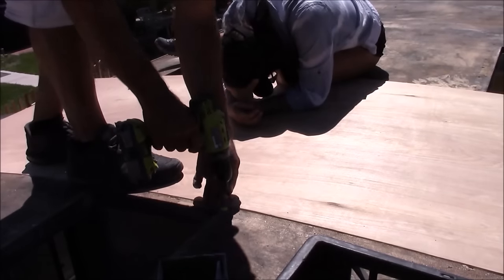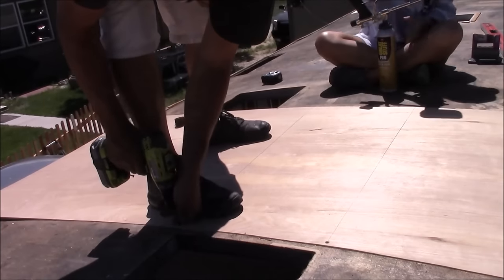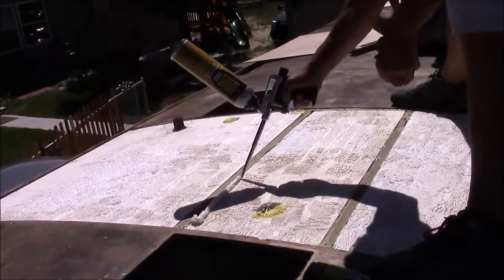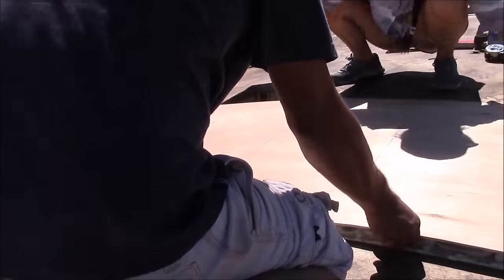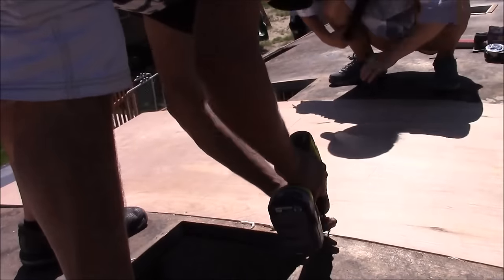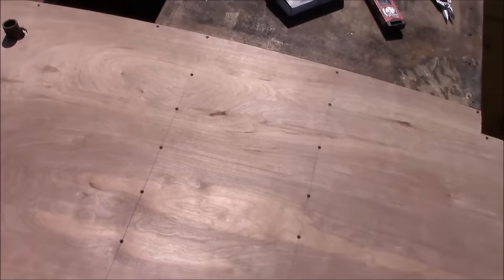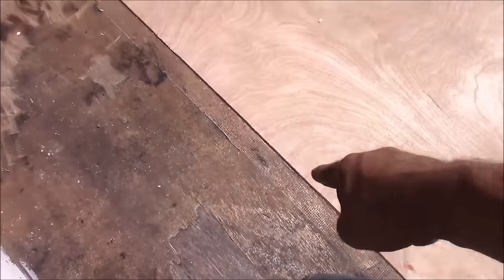Now it's time to install the next piece of plywood. I'm going to dry fit it like the last one, make sure to pre-drill all the holes, then remove the piece and apply my adhesive, quickly laying the wood into place before the adhesive sets. I'm trying to put a screw every five inches anywhere there's framing underneath. On this particular piece, on one side there's no framing, so it may be necessary to weight it down — but the adhesive seems to be holding the joint down just fine.